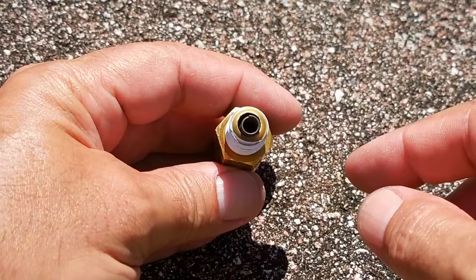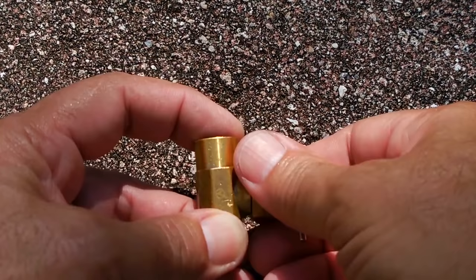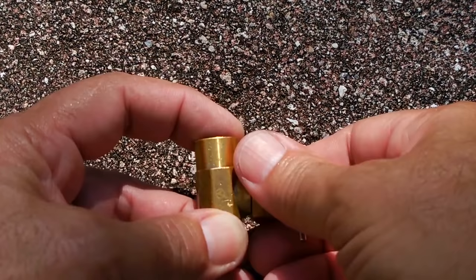Now there is something that I want to show you. I took apart the check valve and you can see the spring is not as springy as it was. The heat changed the temper on the spring. And the shutoff valve had a problem around the stem — the packing all burned up. And that is it.